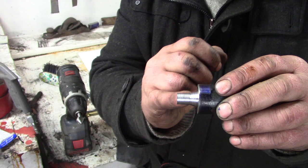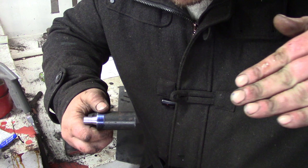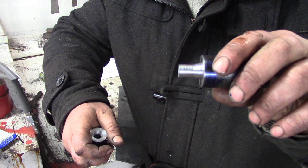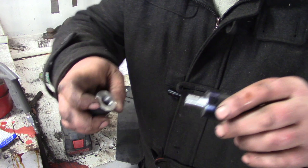The chamfer's a bit short, so it's the same angle, they're both 15 degrees, and this is a much steeper angle than you'll normally see on anything other than tread plate, because the idea of tread plate is you want to bend the metal up towards your foot, as opposed to lightening holes where you just want to have the flange there. I think normally they're about 45 degrees, but this is 15 degrees off the 90 degree, which means it's, hang on, 75, is that right? I don't know, it doesn't really matter anyway. Either way, it's a very steep angle.